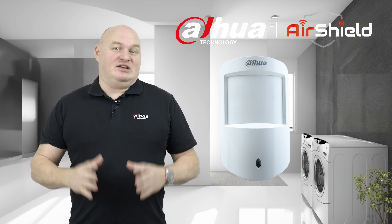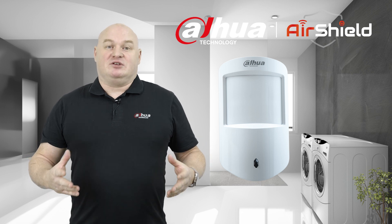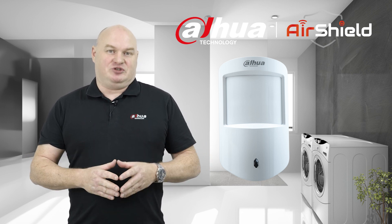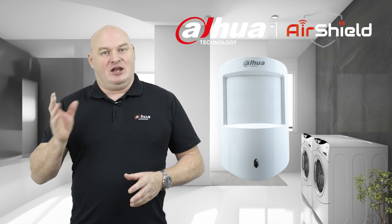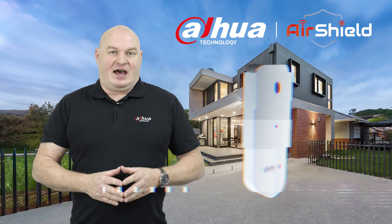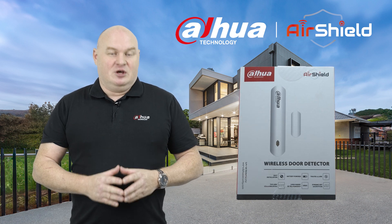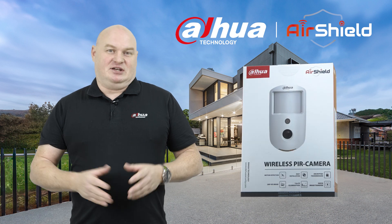At my house, I have various different devices in home mode. There's no way to get into the utility room easily, and there's no reason to go into the utility room at night, so the PIR detector is in home mode there. All of the glass breaks I have around the house and the door contacts are also in home mode. Basically, I've rigged it so just the actual PIRs are not in home mode.